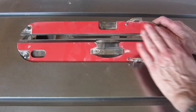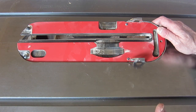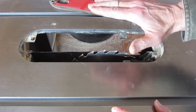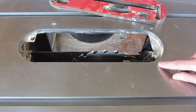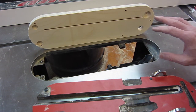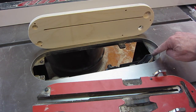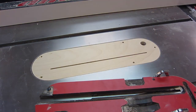There's so much dental work on the bottom of the factory insert that it's intimidating thinking how will I do all that. But in reality, if you're not putting the blade at the absolute maximum height and if you're not doing 45-degree cuts, there's only three protrusions and they can be taken care of with simple counter bores. So the bottom of my insert ends up being quite simple — a recessed hole for this thing and a couple of recessed holes for those bolts. I'll show you how to make it.